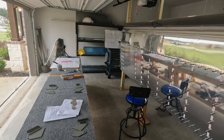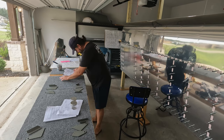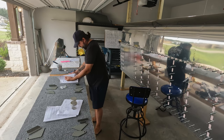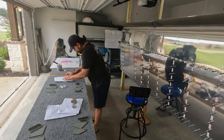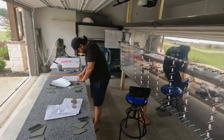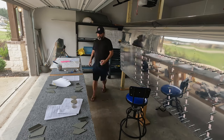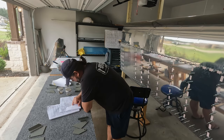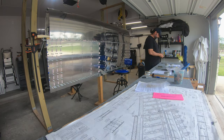Just getting organized with the right rivet sizes. There are some really long rivets for this assembly. You have the AN-426 countersunk rivets — AN-426 4-7, which are pretty long. Then you have AN-470, those are universal or dome head rivets — AN-470 4-9 and 4-11, which are really long rivets.